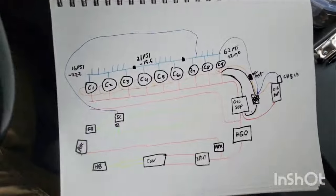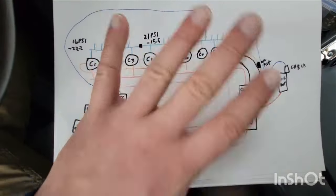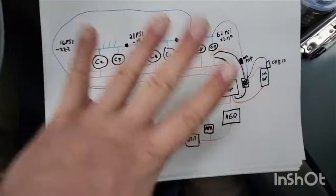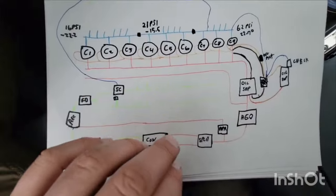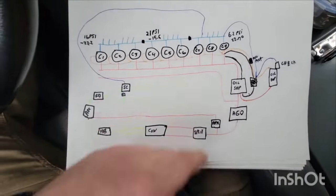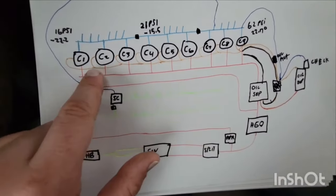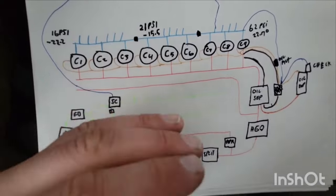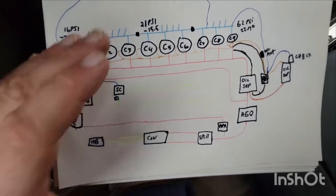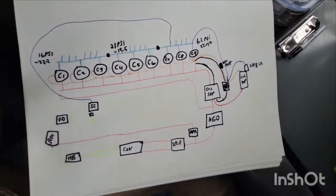I'm going to attach my subcooler playlist below if you really want to dig into that. I think I have 5 videos on subcoolers. It's actually kind of a wild thing, how they fudge it to make it work. But long story short, if this subcooler doesn't work right, then this suction group is going to eventually work its way up to a high temperature. And then you have our special cases that we already discussed previously.